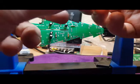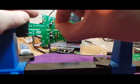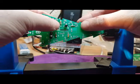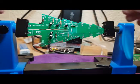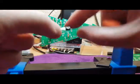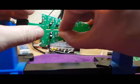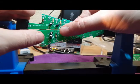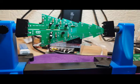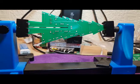No need to bend the pins on these because they're quite tight, so they should hold themselves in the circuit board without moving. So just push them up there. As you can see, they've fitted in quite nicely, and this one has the flats on the bottom all the way around. So again, just slide that in there like that, and then we should be able to just solder those legs in place.